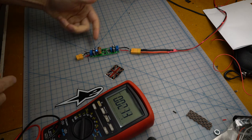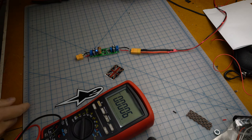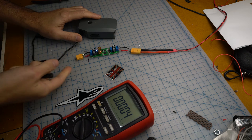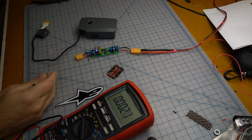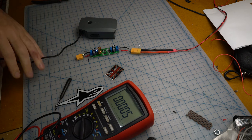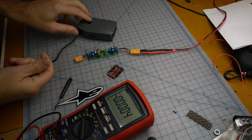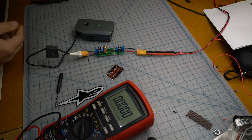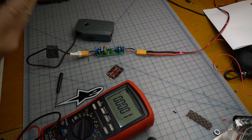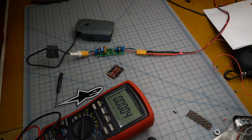So now it's going to output at 13.1 volts, which is what the battery works at to charge. The amperage is completely unrestricted from the bench, so we'll see if this restricts it in any way. We have a problem - it's a full battery on its rundown charge, so the amperage won't be realized. Looking at the bench it's only drawing 0.7 amps. When it gets nearly full it stages down - 5 amps, 2.5, 1.2, 0.7 - getting lower until it finishes. It's right near the end of the charge.